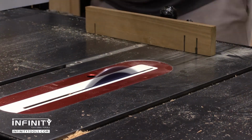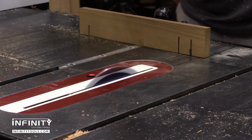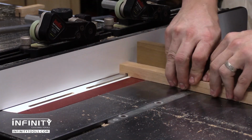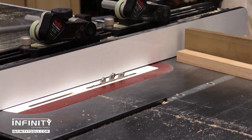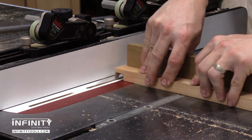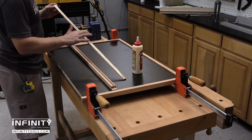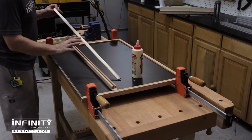The final step is to cut the pieces of edge banding to final length. I do this at the table saw because my miter station is not complete, and then I switch to a quarter kerf blade and put a half lap joint in the front and back pieces of the edge banding, and that's pretty much all the joinery.